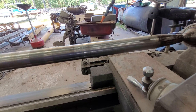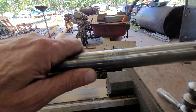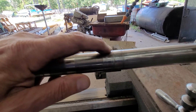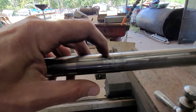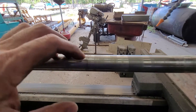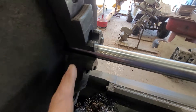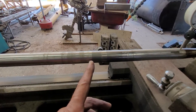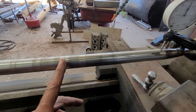This end of the shaft was wobbling badly. We've got a positive-type dripless seal now, not the old-style rope seal — those work fine but they're supposed to drip a little bit, and to me it's just old school technology. So we've got some damage to the shaft in the rope seal region, some rubbing happening here, and damage to the shaft where it had been scraping the boat. The rest of the shaft and the propeller end look pretty clean, with just some minor scuffing from the prop going on and off.